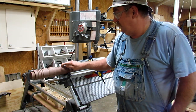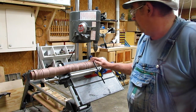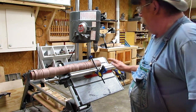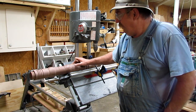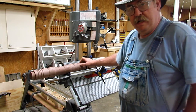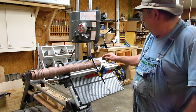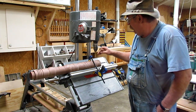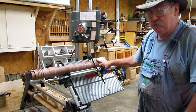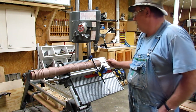There's places in the wood, and it's done like that purposely so it can match some other furniture that's old. But nonetheless, we had to have it somewhat resemble what was there. So that's the reason for the design that's in it. Anyhow, the bottom of it down here we got round, and we're going to have to bore holes for the 5/8 dowel so we can dowel the legs on like the other piece was.